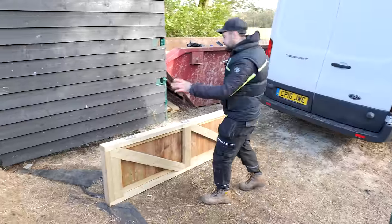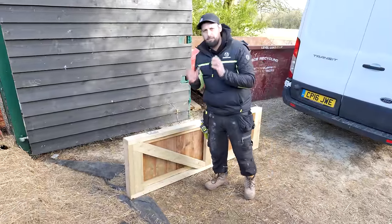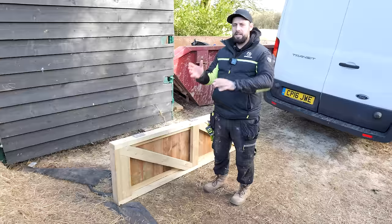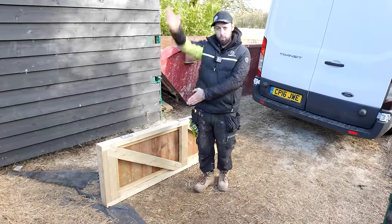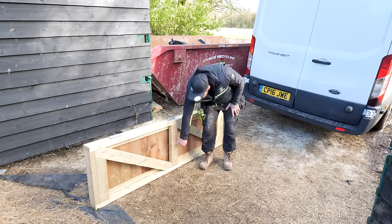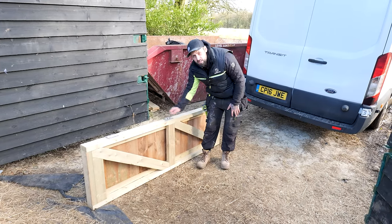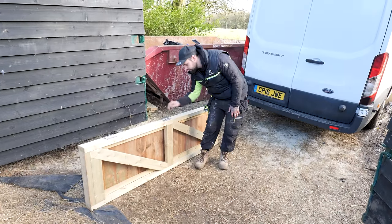So the 9 and the 6-inch, why do we do it odd? That is purely for visual. When you look, the hinges look the same, even though they're not, because of the perspective of the door and where they are. And the center one, where we put our rail, is why we put it in the center. So now we've got strength in the door when we're transferring the weight back to this hinge.